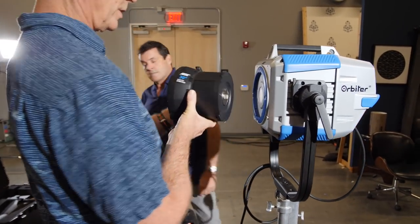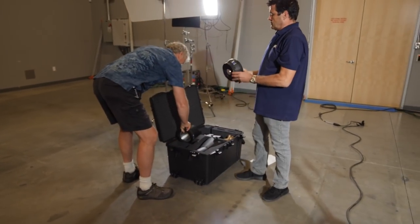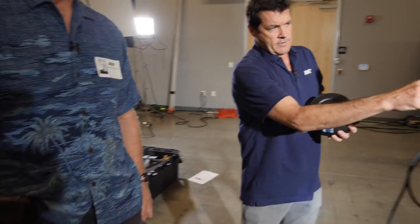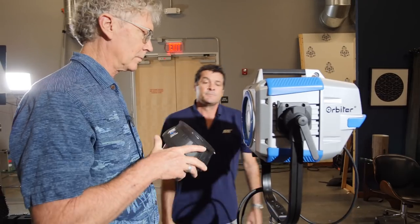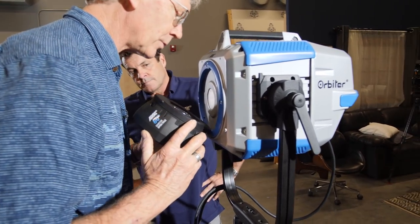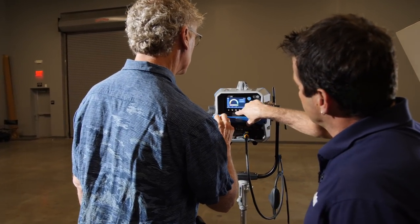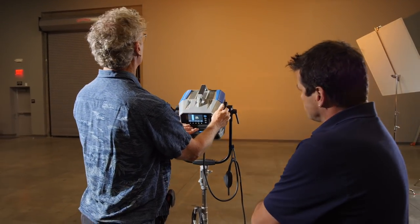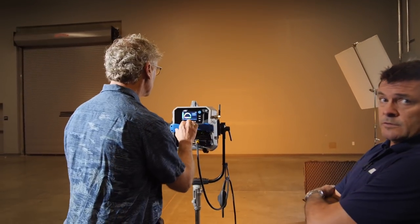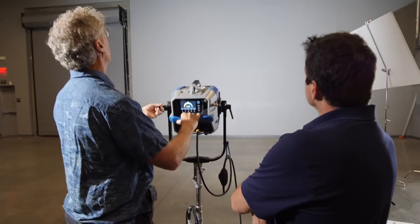Let's try a different lens. This is the 30 we were looking at — sort of the in-between. The options are 60 and 15 — why don't we try the wide? As you look at it, there's a sensor in here so the fixture will know what optic is attached — there's a little chip in each one. There's a little keyway that goes in at about 630 — a little snap in. Nice and wide. That is 60 degrees — I would call it super wide. You can just hold it in a moment to black out; if you hit it twice in intensity mode, it'll do the same.